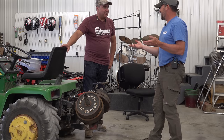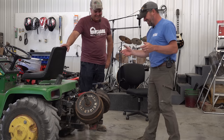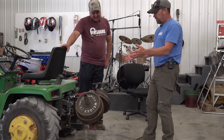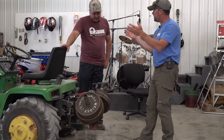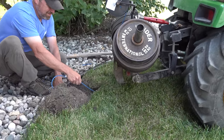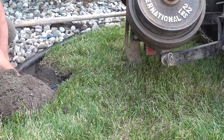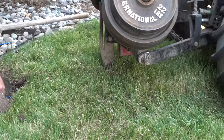Does anybody actually use them? Those systems are really hard to dust. What a perfect use of some weight — I need some ballast for this. There's no down pressure on my three-point hitch, so I need something to get that knife in the ground and keep it from floating up. If I really weight the hitch down, the knife stays where I want it, and we'll be able to plow it in — we're using a little miniature cable plow. Not a new concept, but adapted for use with the garden tractor.